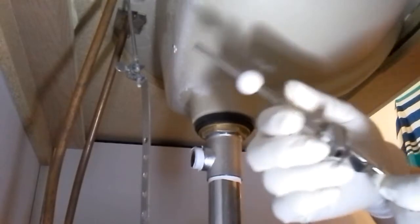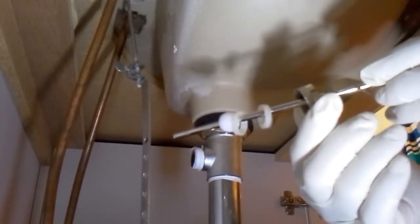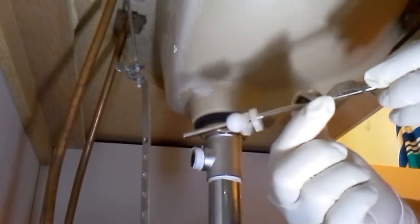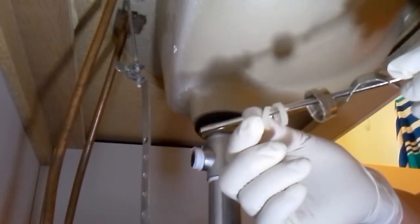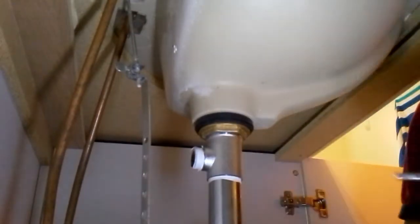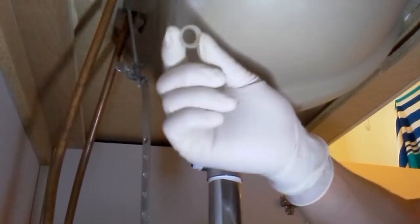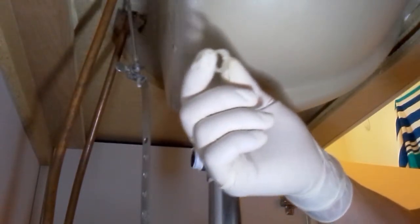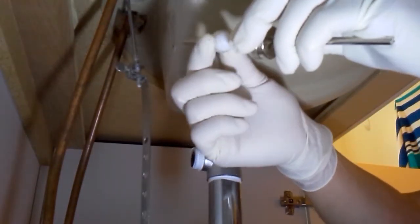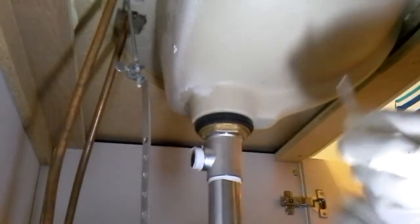So the other part that's here, you'll notice there is the ball. This is the pin, this washer, and inside here is another washer. One should be outside, one should be inside, and this then should close up. Both washers should be around the ball, providing a watertight seal. I don't think it's waterproof, but hope for the best. Both are concave on one end, so when it goes in, it fits into the ball like this, a perfect seal, and the other one does the same thing, and then everything is pushed together towards this, and that would be it.